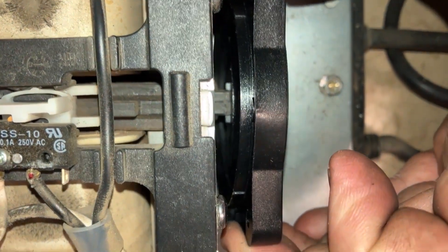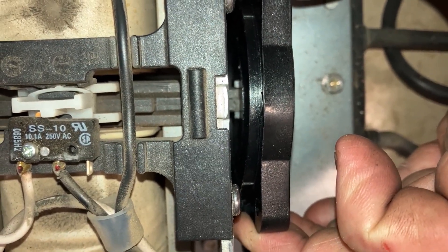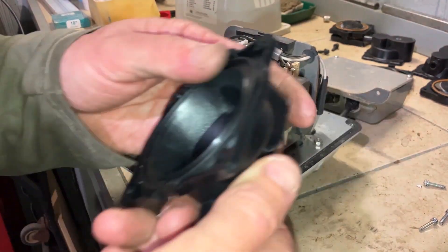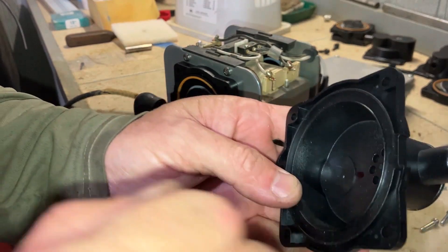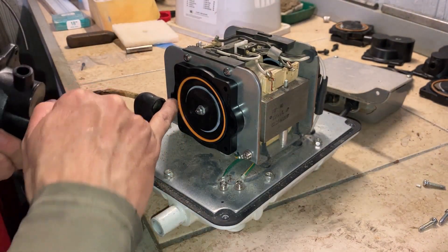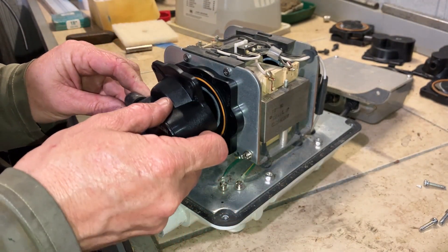Let's see what it should look like when it's bolted up — the diaphragm with the motor block, and then the two raised edges. Once you have the diaphragm on, you can put your check valves on. The check valve has a notch in it that's grooved out — that matches up with the notch over here on this side. This also lines up with the hose, so you can go ahead and stick it onto the hose.